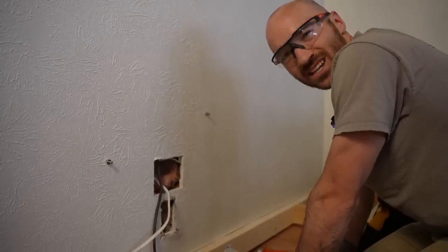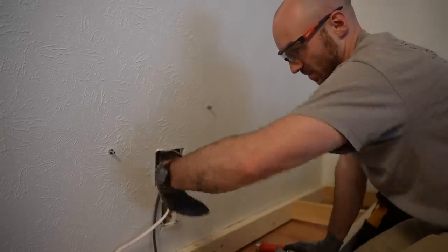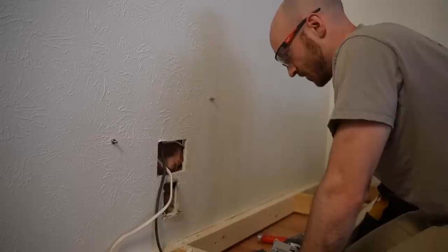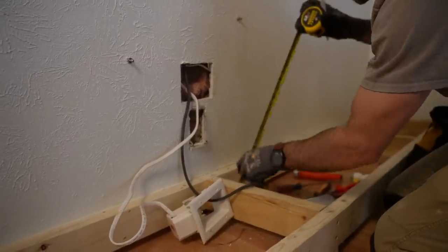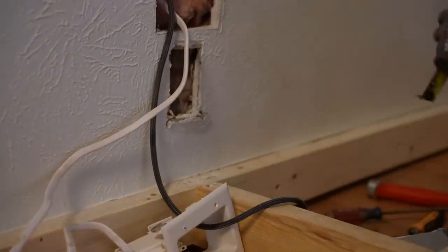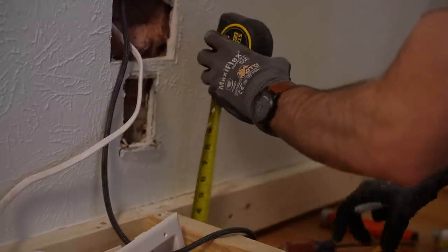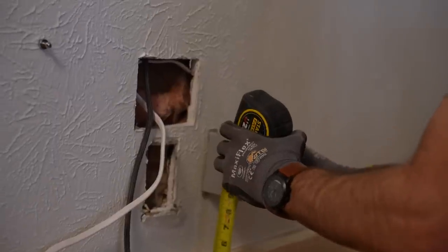I know my location for my new box and I'm actually going to cut it now, so I can pull wire straight up instead of trying to get my wrist in there and then pulling up along where I want the wire — it just makes more sense. So I'm going to get a rough measurement of that height: about 8 inches off the floor.